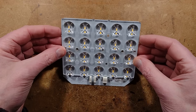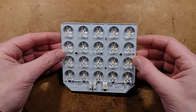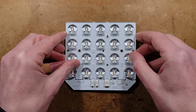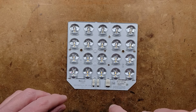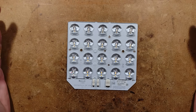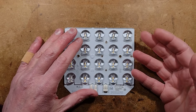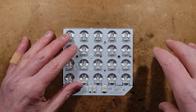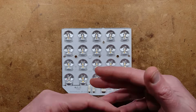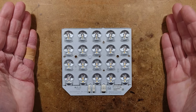If I tilt it from side to side, you'll see that the yellow LED phosphor remains visible. But as soon as I go beyond about here, it starts disappearing. The reason is that LED street lights are designed to spread a rectangle of light along the road, with slight feathering at the edges. All the light gets directed at the road and not onto adjacent buildings. People often say street lighting doesn't look as bright, but in reality the road itself is lit just as bright — with LED lighting it's all directed down. The old high pressure sodium or low pressure sodium lights used to splash light everywhere; these ones focus it into a controlled area.